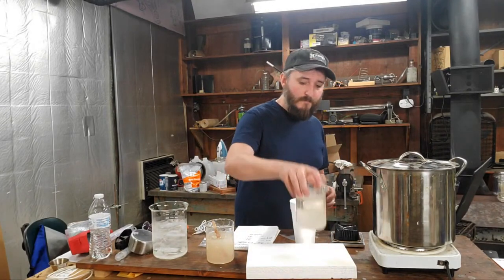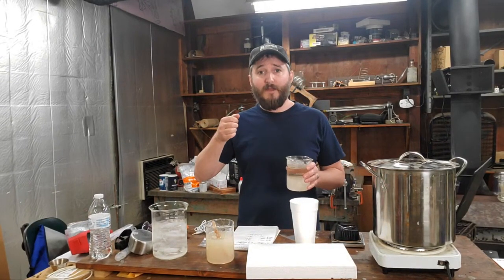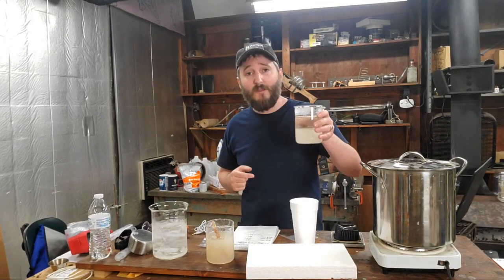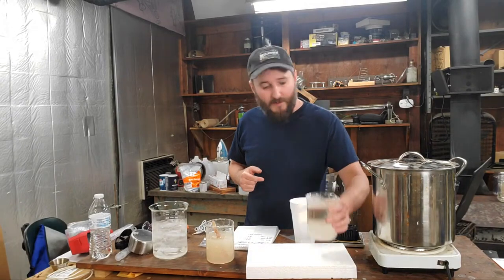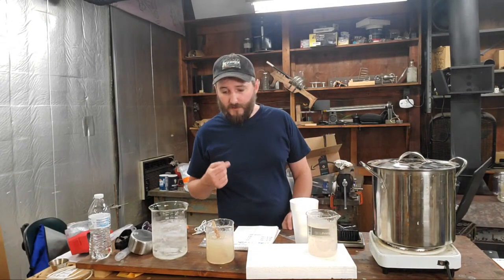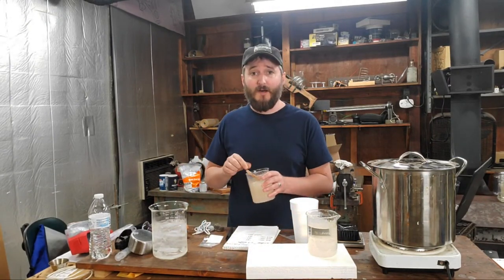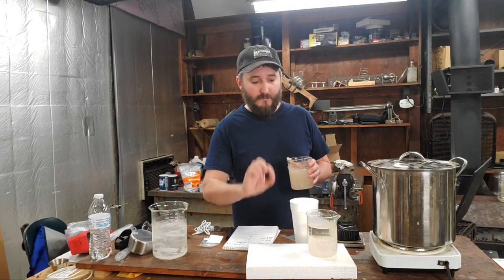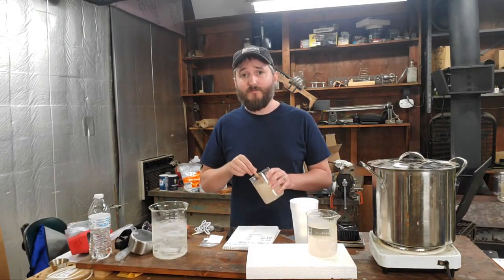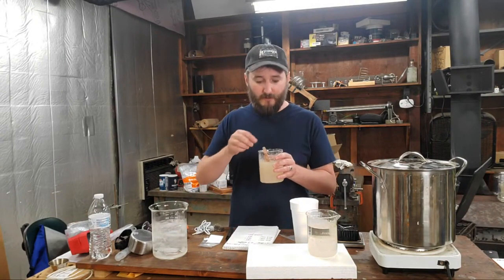If you were trying to use them, say, to cool a building down, you don't want to have to go up into your attic and stir these containers every day between the freeze-thaw cycles in order to get the proper mixture back again. And I've been able to correct that in two ways. First of all, adding the mixture of salts tends to make the crystals more spidery and less like a dense structure that sinks to the bottom. And so they just naturally distribute themselves throughout the entire container a little bit better.